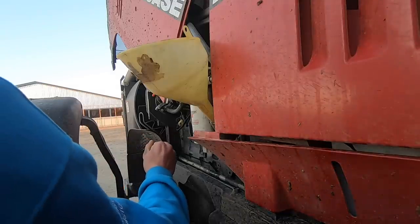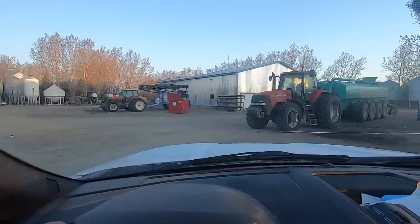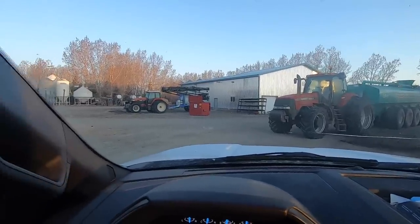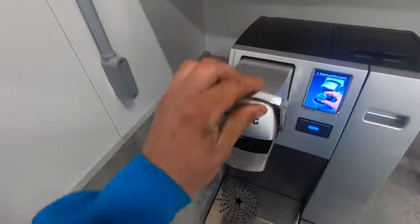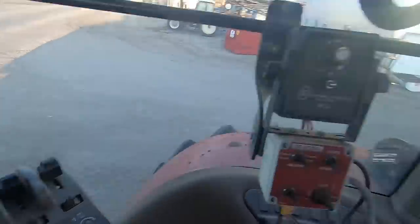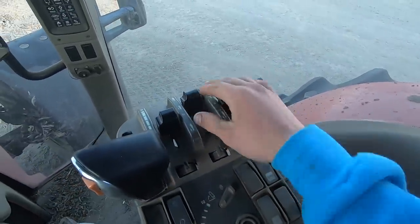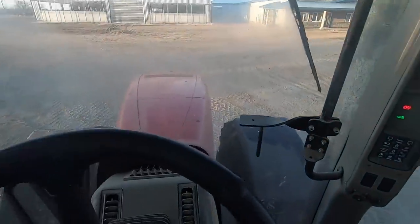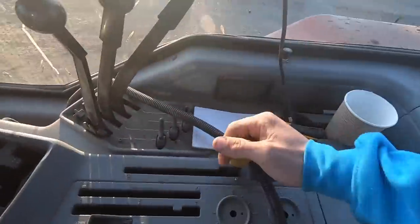It's good enough now. We're gonna let those two tractors warm up, and I'm gonna go take care of the most important thing of every single morning. Just starting off here, I need to get the hydraulics and float for those steering axles — I just click that one forward and then those axles are gonna steer. Now we're gonna go ahead and pull up to that pump and start the PTO up.